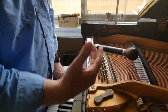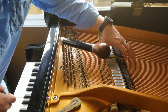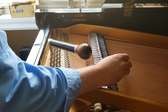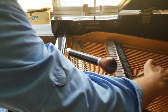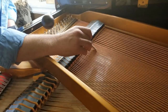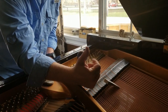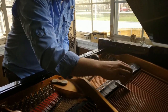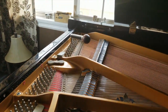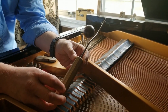What we've got here is a ringing damper — you can hear that. Now, I don't know if it's the damper itself that's sticky. It feels okay, feels like it's dropping okay. So is it one or the other string? If I mute the left string, the damper works. If I mute the right string, you can hear that the left string is ringing. So it's the left string.